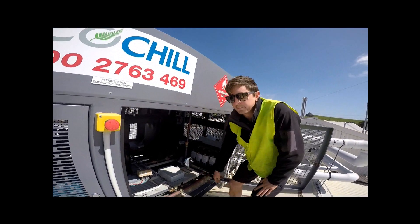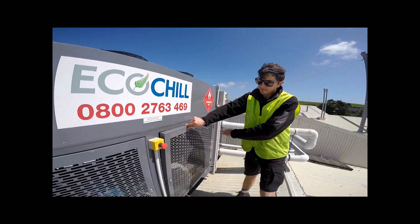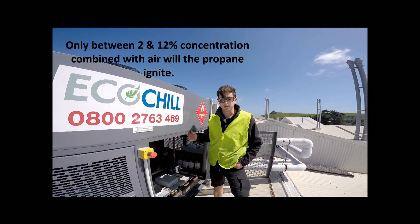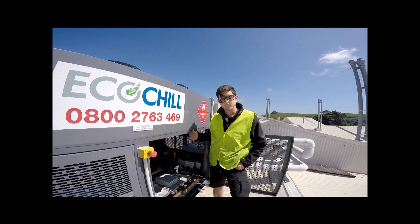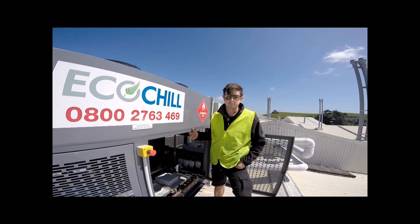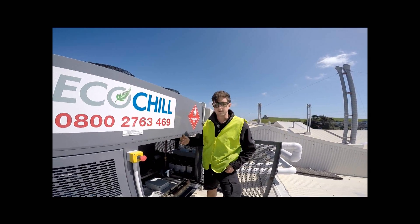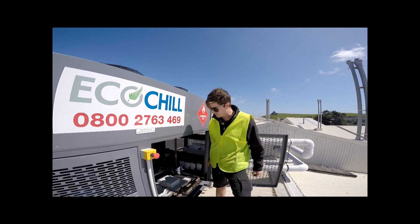Now, in the case of a refrigerant leak, as you can see, all the sides are open to the wind. The explosive or flammable limits are between 2–12% by volume of air, so you'd need a very small amount of wind and an ignition source for any kind of fire at all. And even in that case, it would be similar to a barbecue or a big lighter — not an explosion.